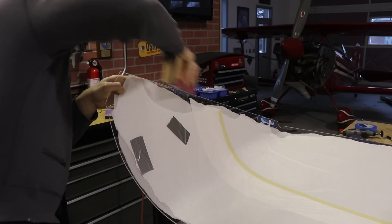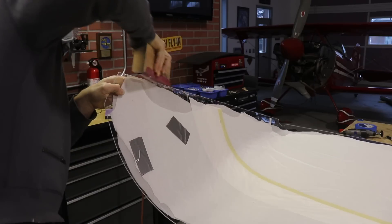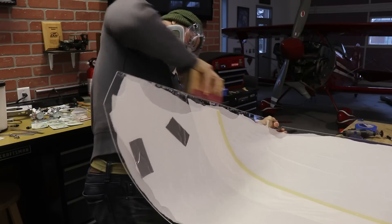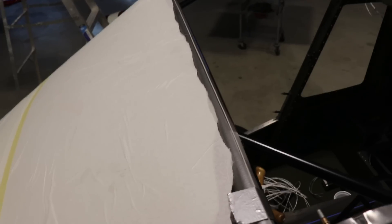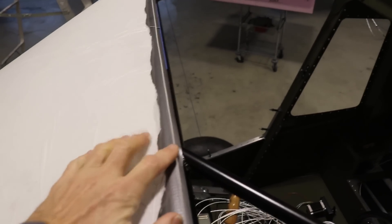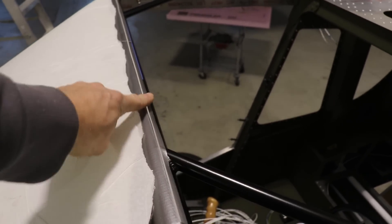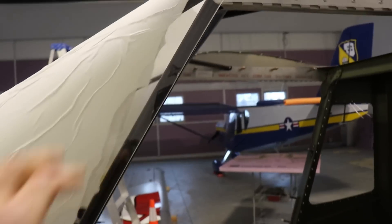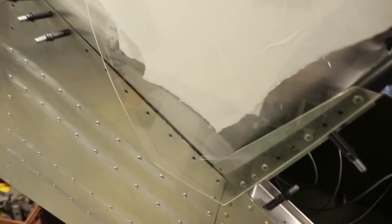Once I'm done cutting, I'll use rough sandpaper to make that cut fairly even and clean up the edges. Once I know everything is done to the final size, then I'll work on really sanding that edge smooth with finer and finer sandpaper to get a really nice finish. I think I'm finally done with the trimming except the very bottom. You can see the top now comes back far enough to where I can get screws in there, so that looks good. I do have to take a long sanding block and sand the back edge because it's cut a little wavy. With the sides trimmed, they're even again with the tube — the only thing left is the very bottom.